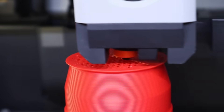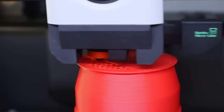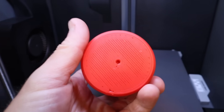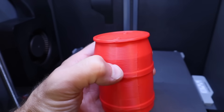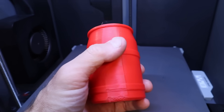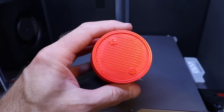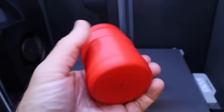And as you can see, it actually worked out pretty well. This one was printed with variable layer height — any time I had an overhang I changed it to a little bit shallower, but otherwise it's a 0.6 millimeter layer height. Experimenting with things I've never done before. The bottom still looks about the same as before. The seam is not quite as nice, but the layer height is higher. I had a little bit of a cooling issue because I'm extruding so much material and it seemed to be having trouble keeping up. I might need to do something about the fan to print at a good speed. The top layer had a little bit of an issue with under-extrusion too — I definitely need to go through the process of calibrating this filament.